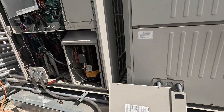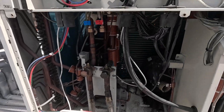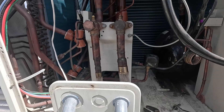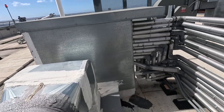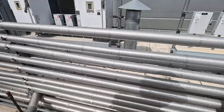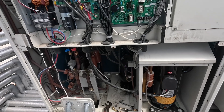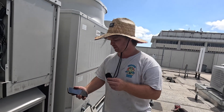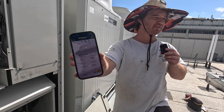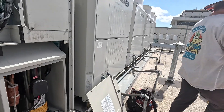So we're having this issue where we had a light drop in pressures — that's kind of why we're out here, to prevent the pressure drop. It's so massive — it's got to go through this whole system. There's so many valves in this thing that the pressures kind of rest and settle. That's comforting — it reached a good point and stayed steady, so that tells us we're on the right track. We know we fixed the leak we knew about. If there's a micro-leak, it's not even dropping anymore. We do have another tank of nitro — we might pump it up a little more. We'll see.